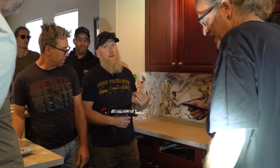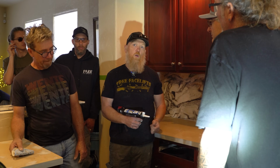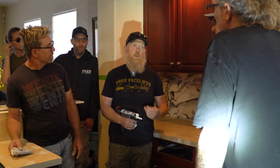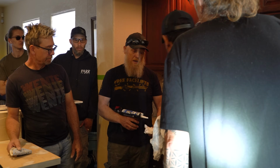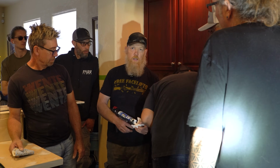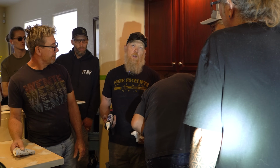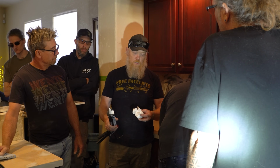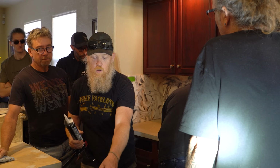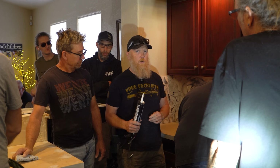And here's my thing. I do not believe that caulking is meant to be a cove baseboard or a smooth rounded corner. Caulking is meant to fill a gap. And I always use paintable. If you notice, I'm using paintable caulk on top of the surface so I don't get fish eyes or delamination issues with my epoxy not bonding to it. And I bond everything with silicone because silicone's an awesome bonding system, but do not caulk your seams using silicone, or epoxy will never stick to it.